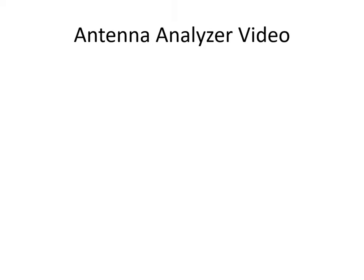Continuing: at 7.300 MHz the SWR is about 1.37. Then I take the reading at the target midpoint — entering 7.238 MHz, hitting the SWR button — and it comes in at about 1.15 or 1.16 after it settles down.